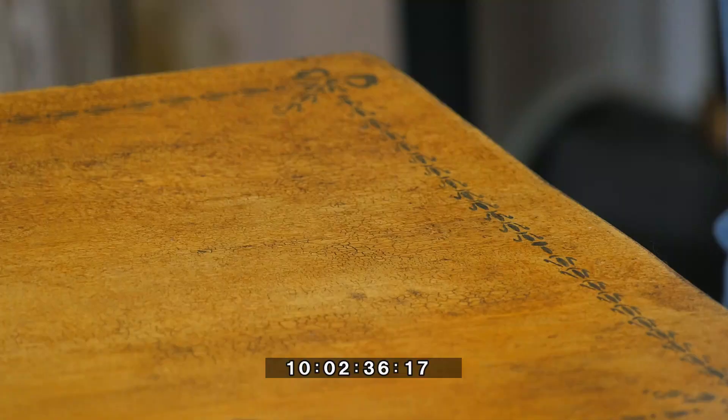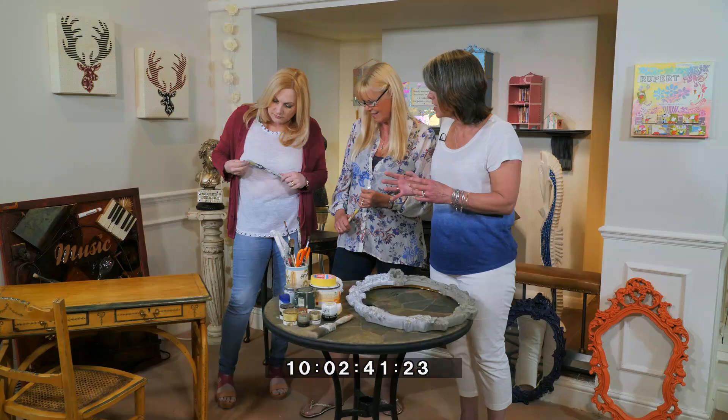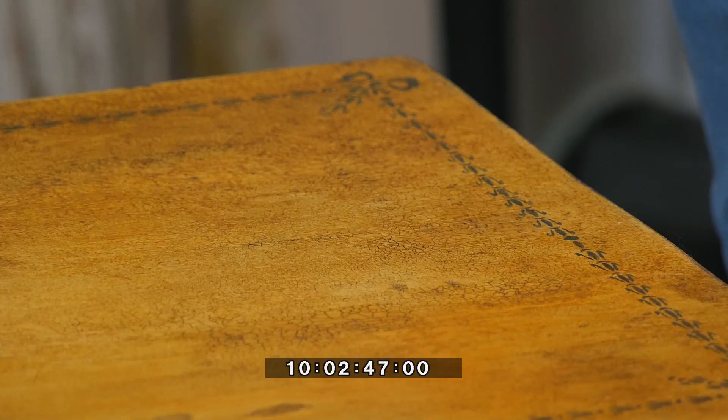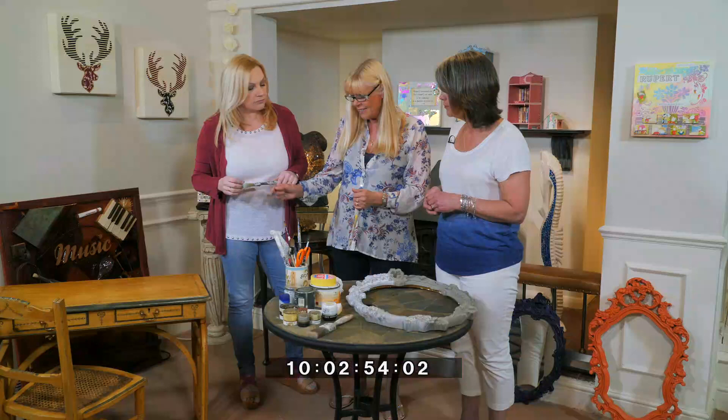Because there was nothing on it — it was bare wood. So to build it up, the cracking is different: on the chair it's tiny, fine details. That's very good cracking. But it's to show that when you have an old piece, it doesn't age exactly the same all the way across. So to give it that appearance of age, you have to build it up and do different types of ageing in different ways.